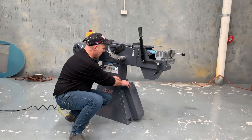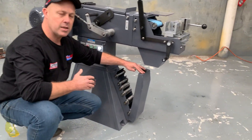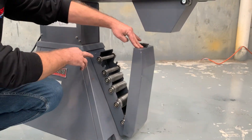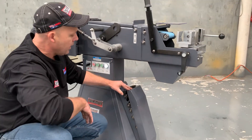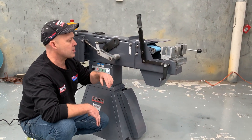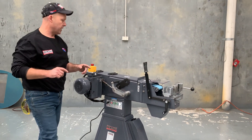We've also included as part of our machine seven formers. You've got the range of basically NB tube and pipe formers, from rod up to the large one there, down to the smaller ones — that's about a 20 NB. We've got a 25 NB former in there at the moment which we'll show you how the machine works later on. About a thousand dollars worth of formers included with the machine, so that's fantastic.